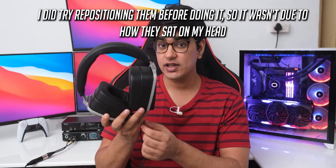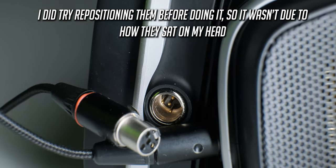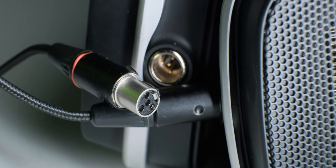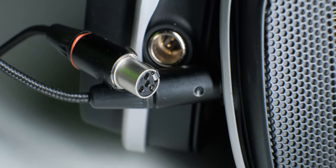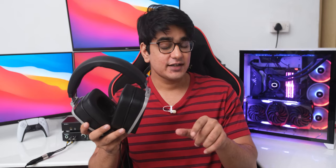One really weird thing is that they can sometimes have a slight rattling in their drivers when playing very bass-heavy tracks like Sunset by The XX — it only happens at very high volumes, but this problem can come and go for some reason, at least on my unit. I was getting this issue, but then I removed the XLR cables and reinserted them, and the problem was gone. So this doesn't appear to be a quality control issue, but something related to how the AMT drivers handle being powered. In any case, this is not an issue to be worried about unless you get a unit that is actually defective.